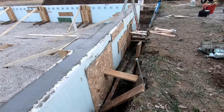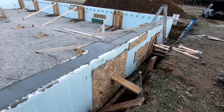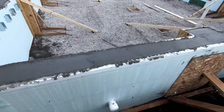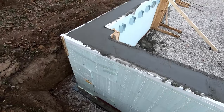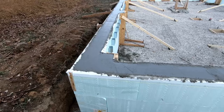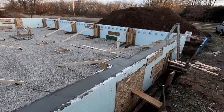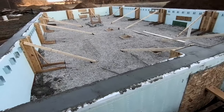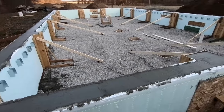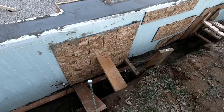But if you're doing this in the future, anywhere that you cut those black braces inside the Nudura, you need to somehow re-brace those, either with tie wire to the outside of the forms or whatever you need to do, because that's where they all broke out. This side was the worst. This side broke out